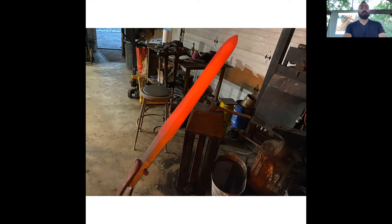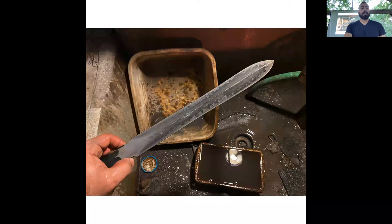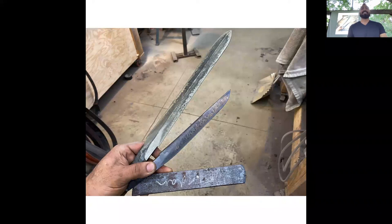You need to understand your material, your cross-section, your quenchant, in this case water, and your heat. And if you can control all of those things just right, you can make these really active, crazy patterns on the blade without the use of any sort of clay or refractory to influence them. And so this sort of hardening without clay is the real magic to me. If I can make that happen and it doesn't crack and it actually works, I feel very, very happy.